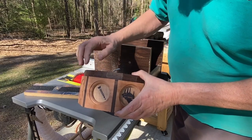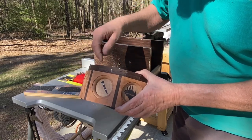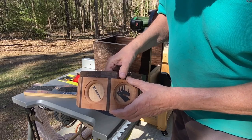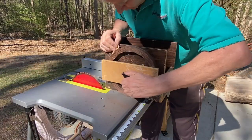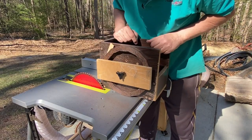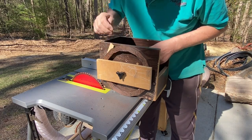This one ring should do both. I want it about the same thickness, so I need roughly 3/8 of an inch. This ring is 0.9 inches thick, so I'm going to try to split it in half. Before I try to cut this, I have flattened both sides of the wenge ring and sanded it on the lathe, so it is ready to glue.